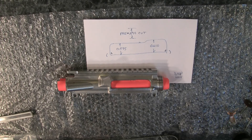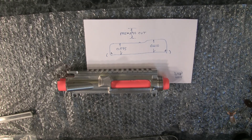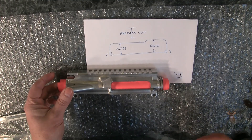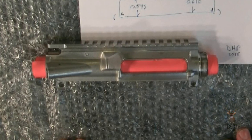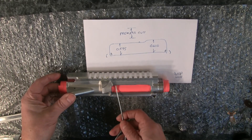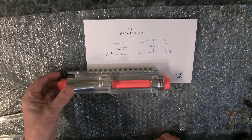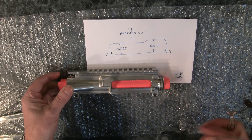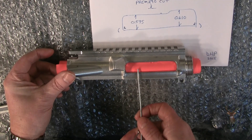When I started to build this particular project, I went to look for the dimensions of the port for a 458 SOCOM or similar 450 Bushmaster, that type of thing. I went looking for uppers and found them more expensive than I thought they needed to be, considering there's just a little bit of modification in the port. I looked for dimensions and found a similar upper that wasn't mil-spec. It didn't look like it was going to work, and I didn't really want to grind off the upper edge — there's a divot right there for the dust cover, and I didn't want to lose that functionality. So I looked around, saw some pictures, and they take a little bit off in this area, square up those corners, and take this edge down. I figured I could probably do that.